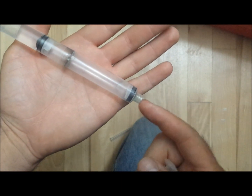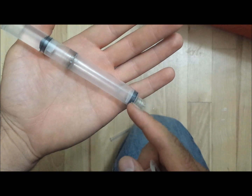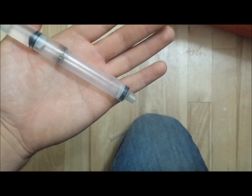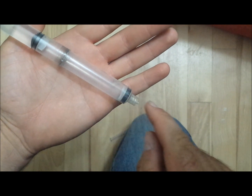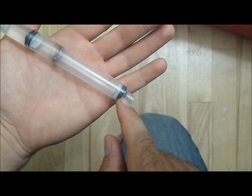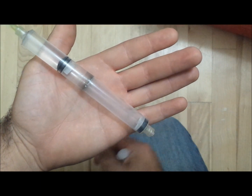The reason for that is you've got to build up pressure in here. The way they actually do it is they use a syringe with air — they put it on the end and press air into it. Air is going to make its way around the plunger because it's not a tight seal. And when you pull off the back, the change in pressure means it's going to try to push the air out, which forces the plunger into the hole to block it. That's basically how it works.